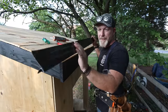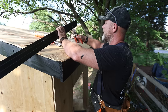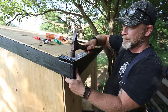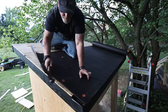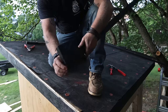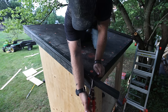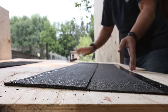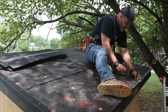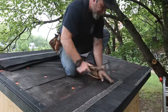For roofing, the first thing is to install the drip edge on the back, but we can't leave it extended past the roof so we cut a return into it and bend it so it folds right underneath. After installing the back drip edge I rolled out roof felt and secured it using Plascap nails. Then I put the drip edge on the rake of the roof right over that felt, again cutting a return but this time on the peak side. I need to cut a starter strip, which can be cut from a full-size shingle using a utility knife, and I place a full starter strip on the bottom end of the roof making sure it overlaps the drip edge on both sides by 3/8 of an inch, then secure it using roofing nails.